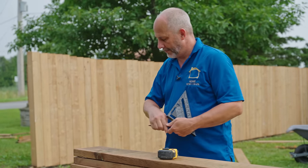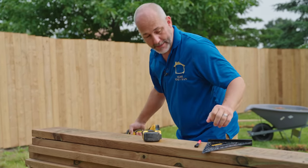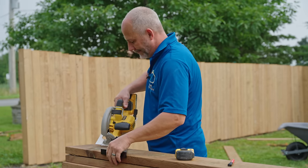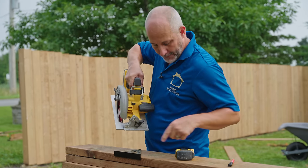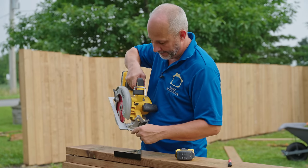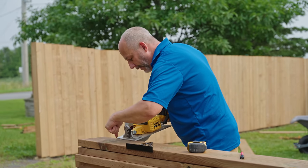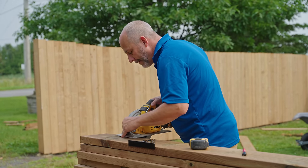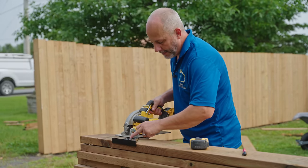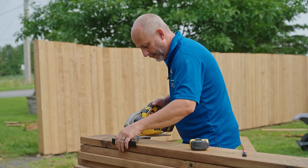So here we go — nine foot six, mark that, square the marker line. For those who aren't aware, I always take a black marker and mark on my table where the blade is going to cut, so I know exactly how to line this up. I put my black mark right on that other black mark and it'll be perfect every single time. I can use the square here as a running guide and that keeps my saw blade going straight through instead of on an angle.